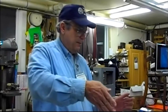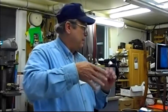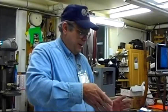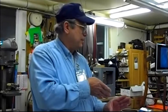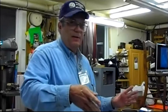Printing plates for currency was done on what's called a linear Rose engine. They could do line stuff, repetitive. Rose engines do stuff repetitively, incredibly repetitive. And they would make currency with these fancy designs, just like we have today. But today we use CNC machines. They would use these to make the background stuff. That's what gave counterfeiters a hard time, because they could not repeat that exact pattern, trying to do it by hand. And the folks that are doing the plates are doing them with linear Rose engines.